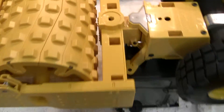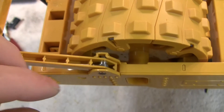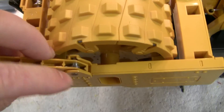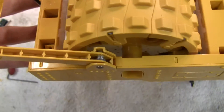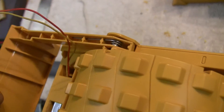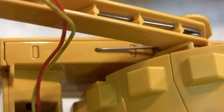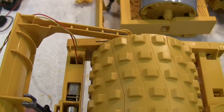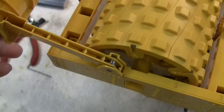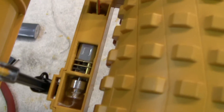What I ended up doing was making a spring for each side — left and right. I drilled out the plastic little tabs that are on here and put in some 316 stainless steel pins. The springs take care of the downward action on both sides. You can see it's drilled up into there, and the other side is drilled and bent up into the structure so it can't move. It's actually a bit on the stiff side — it'll almost lift the front of the machine off the ground, and keep in mind there's no weight in the rollers yet.